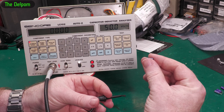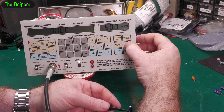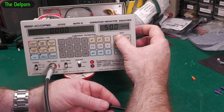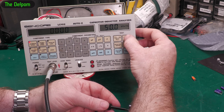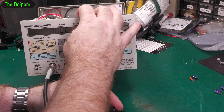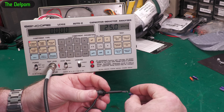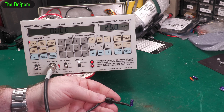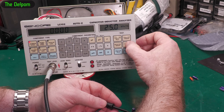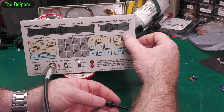There's a 2.2 somewhere — is that 50V as well? I think it was. Yep, 2.2 50V. So let's do that. ESR — good. Capacitance — good. Leakage — good. Let's do 25V, 10 microfarad, which is what all these ones are. I'm expecting these to be okay as well because these are high quality caps, only 85 degree rated, but they're all Nichicon. Good. Good. Good. Good.